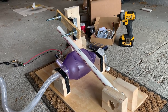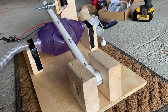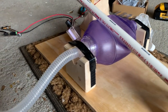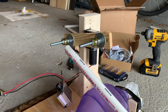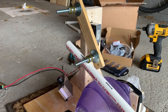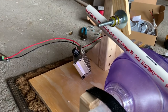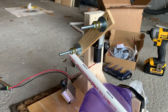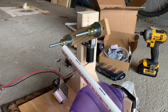This is all very simple stuff, nothing too complicated. There's no real leverage down here — this is just pure PVC and a T-connector. The bag valve mask is just held in place with Velcro. You can get a little look at the rotation mechanism and the pushing mechanism up there. Rate is controlled at the PWM module here — you can turn the rate up and down. If you wanted to have an even slower rate, you could take off one of the compression axles, one of the pushing axles there, and basically halve the rate.